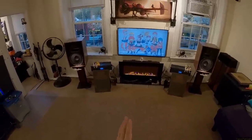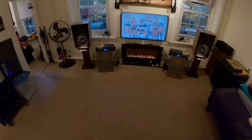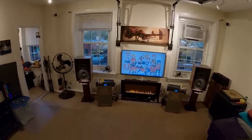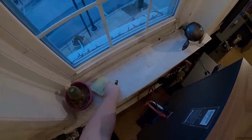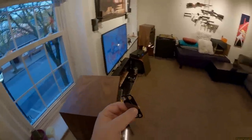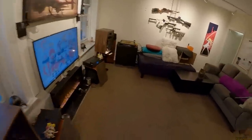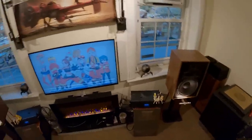On to the final fix — and I did an entire video on my other channel for this, because it's the video where I wrote on the whiteboard describing how I set up my living room, which came as a result of these speakers. Here's the main problem. In the first part of this review when I had them on the floor, I had them set up absolutely stock. These are the bridges that go between the high and low terminals in the back. These bridges mean you can use one amplifier and it'll power the 12-inch and the upper horns. When you take these out, you can separate the upper horns.